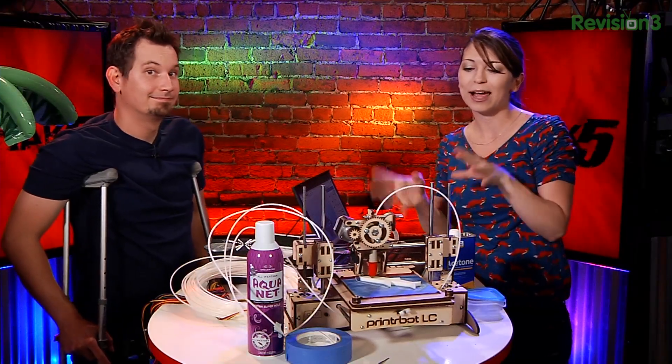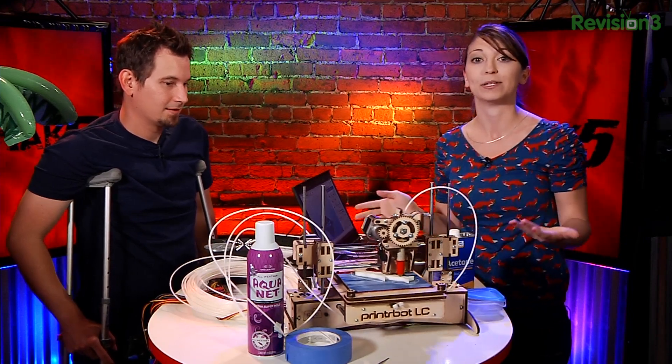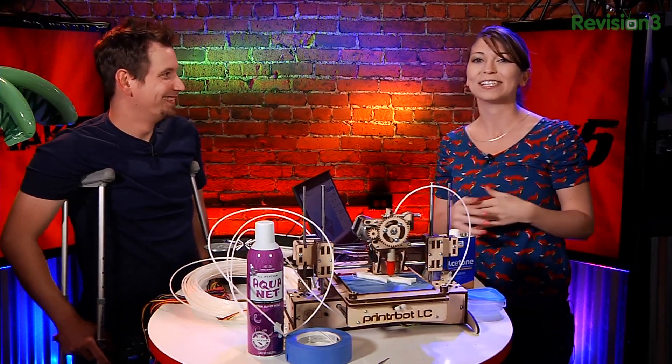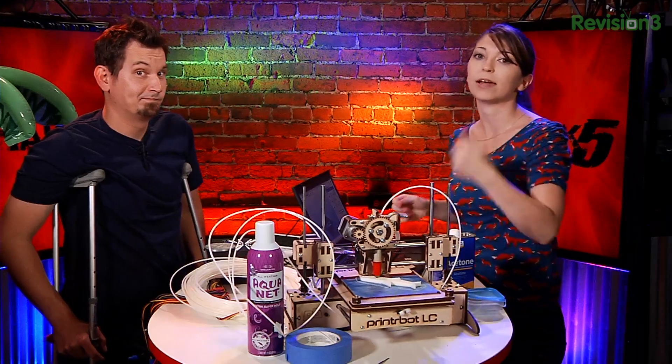My little shark takes about an hour and 15 minutes to print. You also want to do a test print by heating up the filament to 230 degrees Celsius and then squeezing some filament out of the extruder. That's going to make sure that if there's any excess filament on the outside or inside of the nozzle, you squeeze it through and pull out whatever's in there. That might be something you just need to do at the end of every print — it'll help clean out your nozzle.